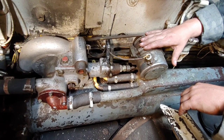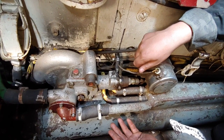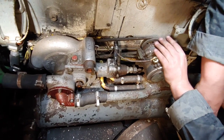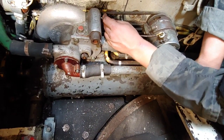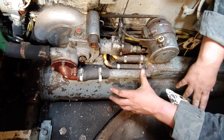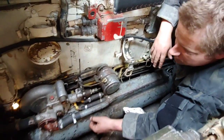We turn on this electronic pump, which gets power from the battery, and then the battery just has to power the ignition plug. One thing I think is great about Soviet systems is everything has a manual backup in case of failure. Even if this electronic motor fails during your preheat, you can disengage it and actually manually hand crank and manually pump heated coolant through the system in case you lose a belt or your electronic motor doesn't work. When they went into the T-62, they made this unit slightly smaller — this one's more unique to the T-55.